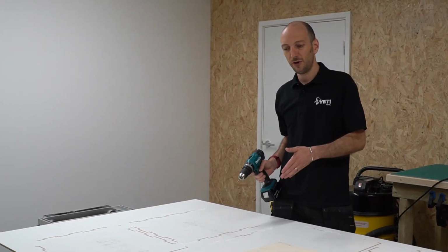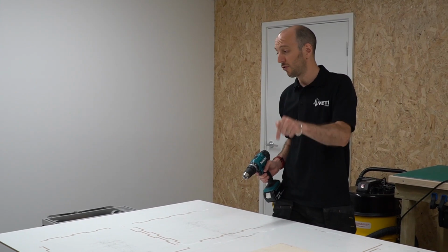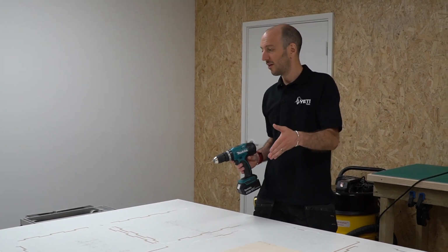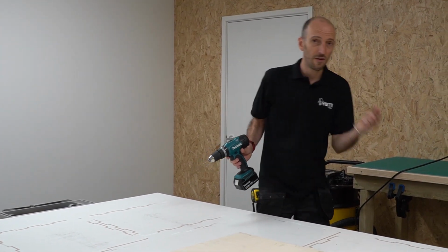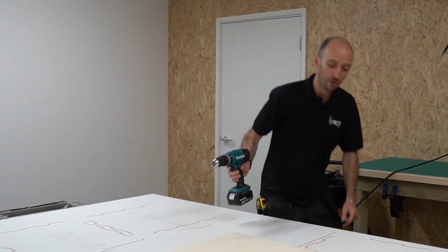When I'm screwing through all of the woods, I want to make sure that I reach the clamp panel and that the screw doesn't go through the aluminium extrusions of the Y-bench. An easy way to find out where your cross beams are on the Y-bench when you've got material in the way is just have a look underneath that spoil board and you'll see bolt holes wherever there's a cross beam.